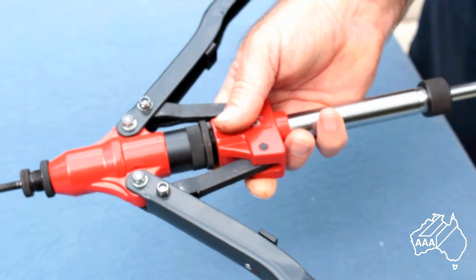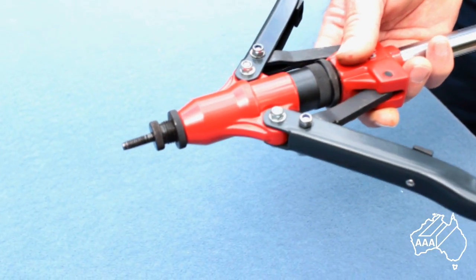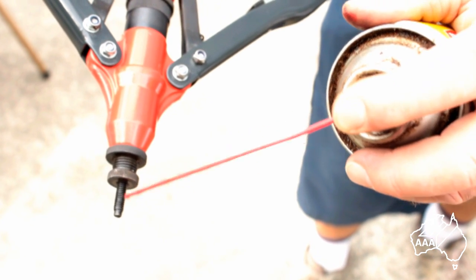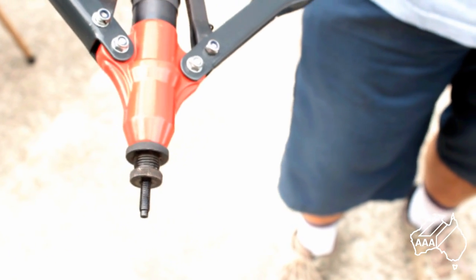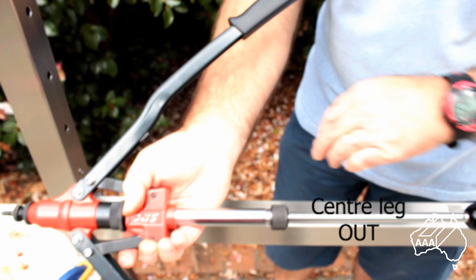Next, screw the knurled collar back on and it is ready for use. Lastly, test that the tool is operating properly by pulling the centre knob in and out — the mandrel should rotate freely. To insert the left-hand blind rivet nuts, begin by spraying some lubricant onto the mandrel. This will make it easier to release it from the crimped blind rivet nut. For crimping the left-hand rivet nuts, you must check that the centre leg is pulled all the way out. This is important or you will have difficulties releasing the blind rivet nut from the mandrel. It is good practice to always pull the centre knob out each time you screw a left-hand rivet nut onto the mandrel.